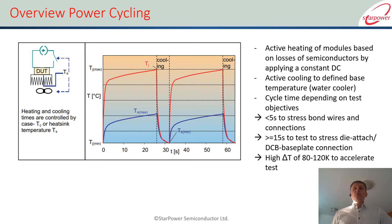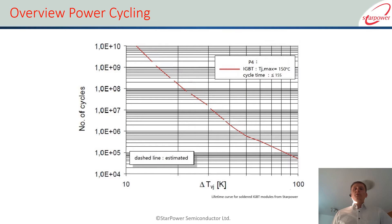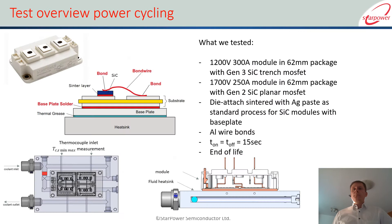The delta T chosen is usually between 80 and 120 kelvin — a large delta T to accelerate the test, even though in reality you would never use such a large temperature range. Then you extrapolate your results to what actually happens in your application. When you do that, what you would normally achieve is something like the classic curve for an IGBT, and so far a lot of our customers have come to us saying this is something they would like for silicon carbide as well. On the market there is not much information, so we thought we need to investigate and put some resources into testing.